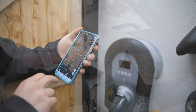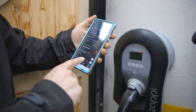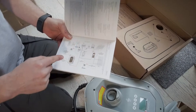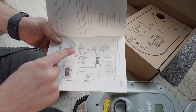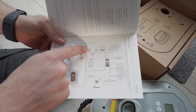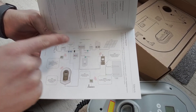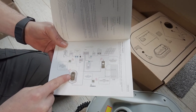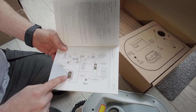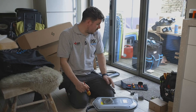On this particular system it comes with a phone app that you download. The reason we're using this type of charger is it's going to work in conjunction with the solar panels. The way it works is it senses what comes back through the grid from the solar panels and uses the surplus energy generated by the solar panels to feed back to the car charging unit, which obviously saves you more money.